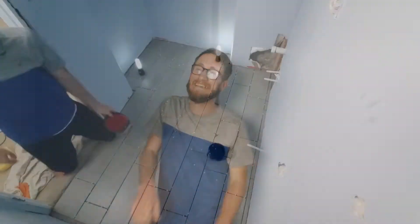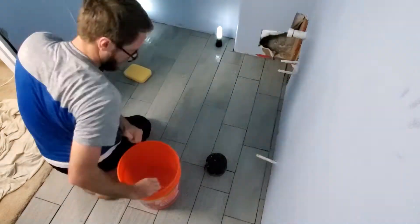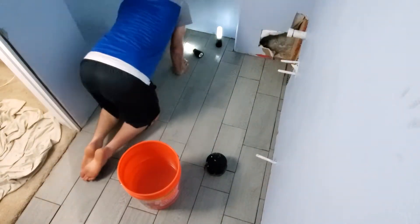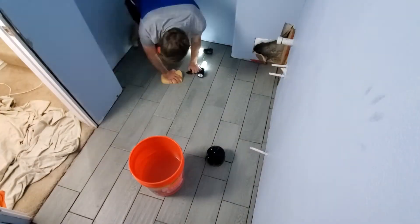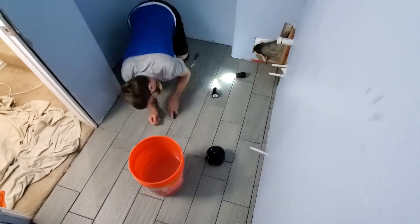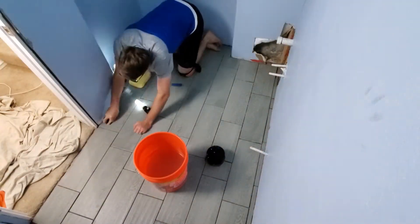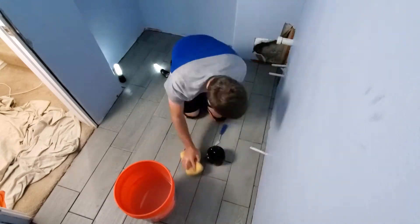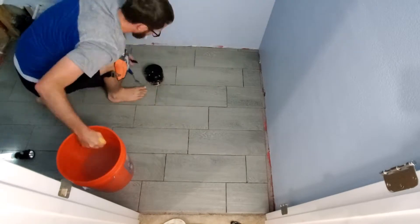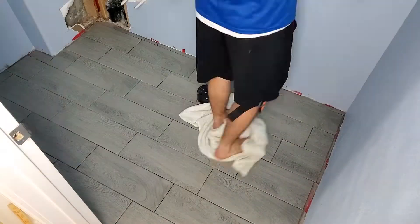What's up, my people? Andy here — Andy Vlogs — doing the next episode in our series of finishing the bathroom in the basement while also laying tile. As I mentioned, we're going to put grout in, but first I had to do about an hour of touch-up and cleanup because I was too messy. If you are doing tile, make sure you clean the tiles off after you've laid the thin set — use those big tile sponges. Otherwise you're gonna have to scrub like I did, because I had thin set mortar dry on top of the tile. I used this little grout cleaner that almost looked like a razor blade.